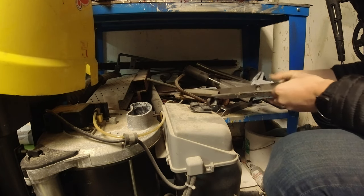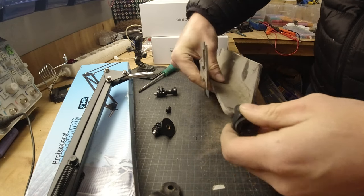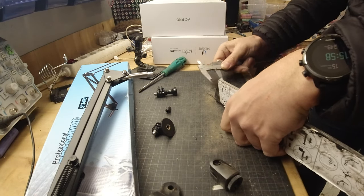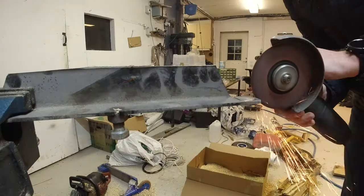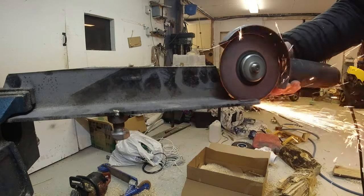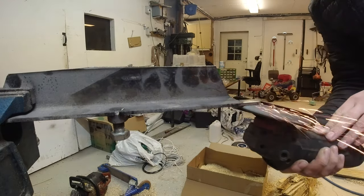To mount the gear itself I need some hardware between the actual arms and the camera stand. So I picked out a piece of steel bar that I had, and I'm marking out where to cut and where to drill. The angle grinder makes quick work of cutting the steel into pieces to the size I need. I'm also making sure to round off all the edges on the pieces before I cut them off totally.